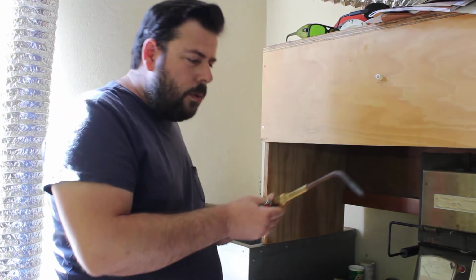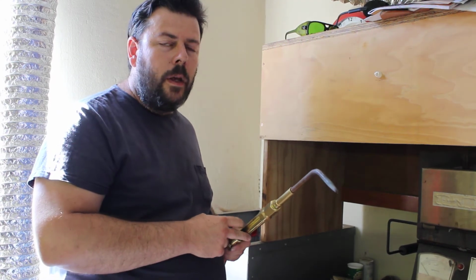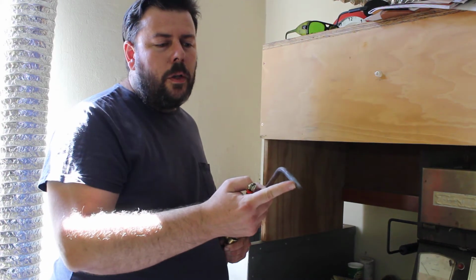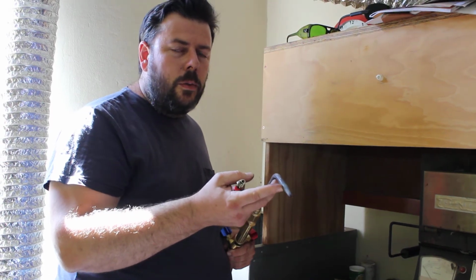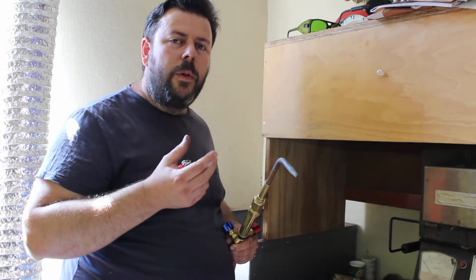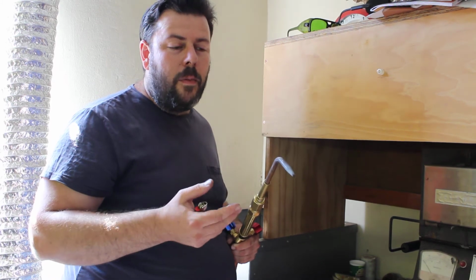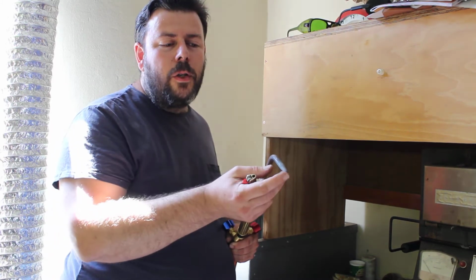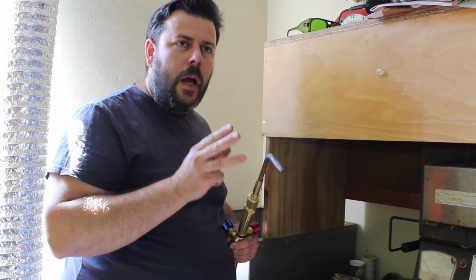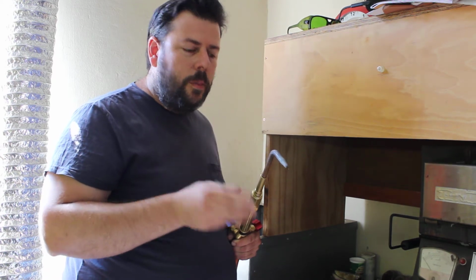The gas we use is propane gas, LPG, and oxygen. The nozzle that we use is not a cutting torch nozzle, because what you want is an effective flame. You want to avoid excessive turbulence in your flame. So what we use is a brazing nozzle of a very large size. That gives you a nice controllable flame that is effective without excessive turbulence.